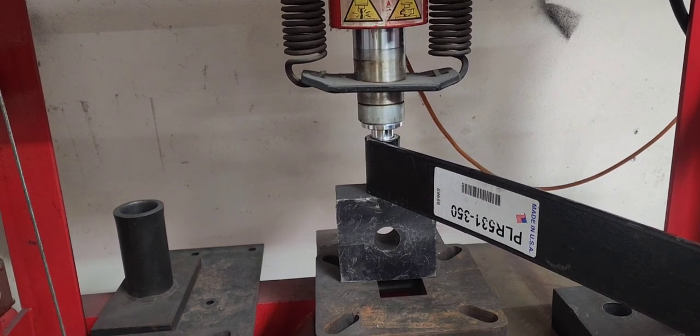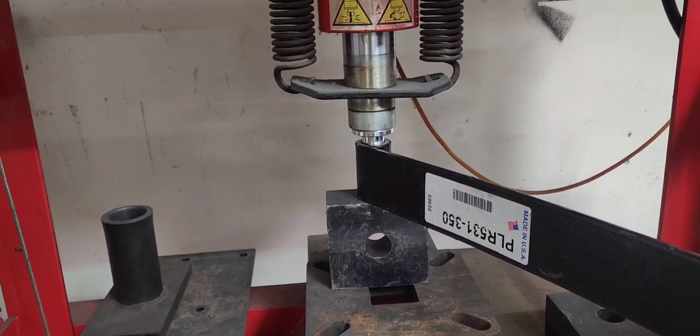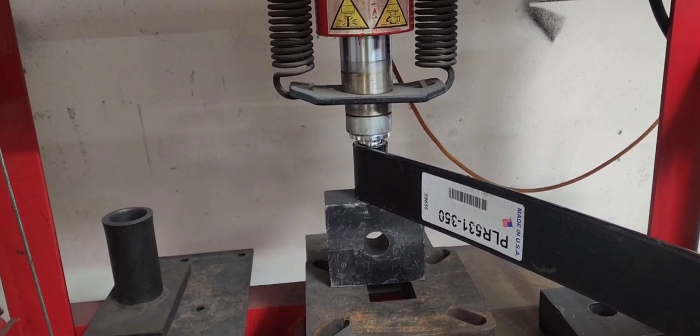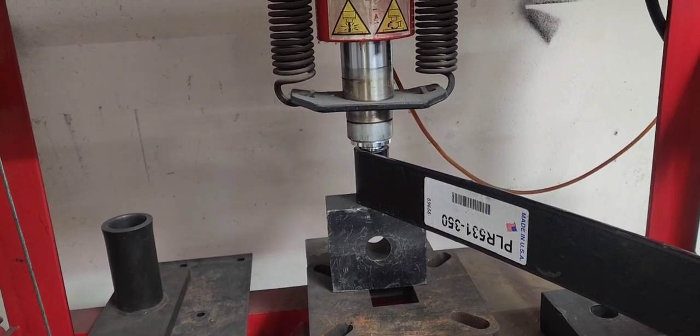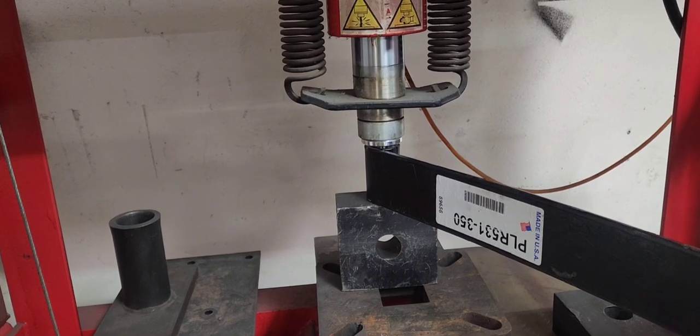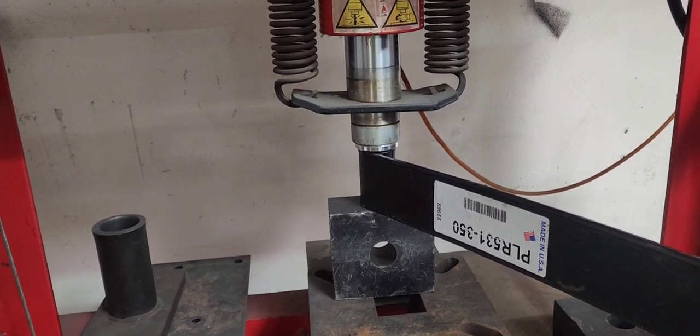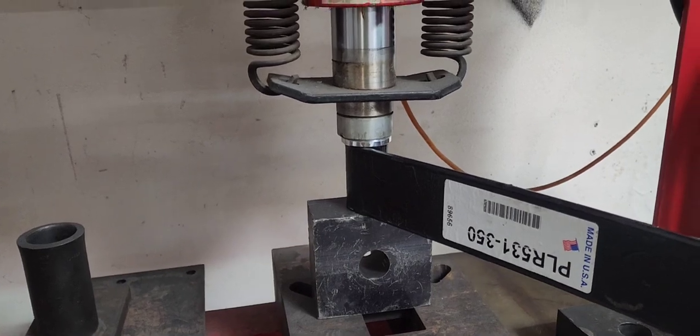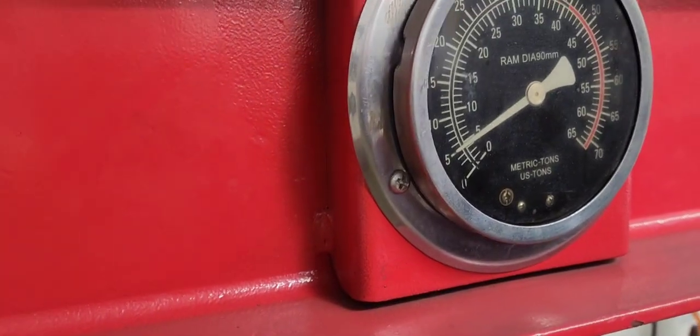It's not taking a tremendous amount of pressure to push it in, but that aluminum bushing is going to be slightly deformed after we press it into the spring — there's just no two ways about it. It's part of the process. If I leave the bushing too loose it'll spin and eventually wear out, and if I put it in way too tight it's going to deform a lot. I think I've got the press just right for these pieces. There we go — it's bottomed out at about five tons.